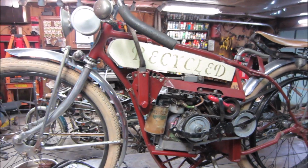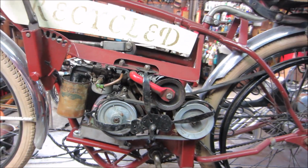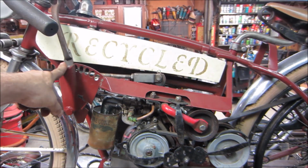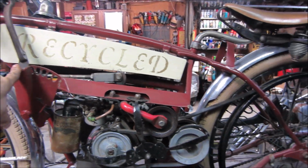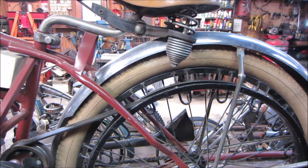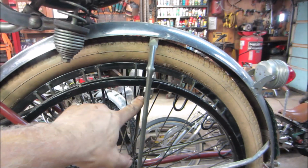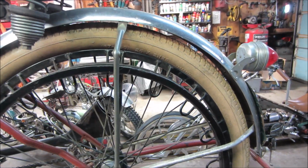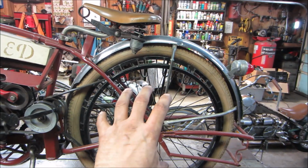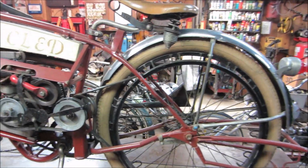Now we can see this one a little. This is, again, a Rio four-stroke going to a belt slip setup. It's got a suicide shifter, I guess we're going to call it. Belt drive on the back. Serpentine again. It is using another bike, a 24-inch rim on a 26. And these are like staples for conduit, just welded to the rim, used as standoffs. The hardest part about those is getting that thing right on the money so that when it's rolling, it's not doing one of these.